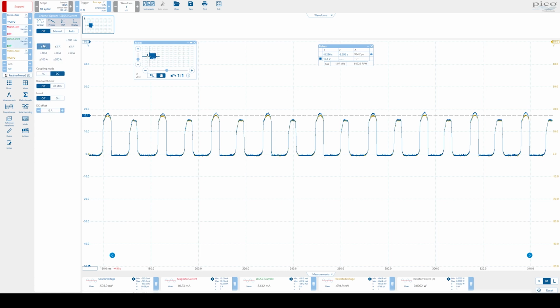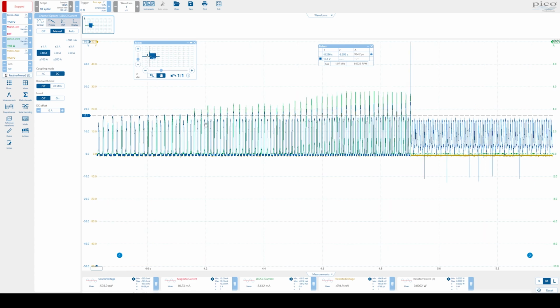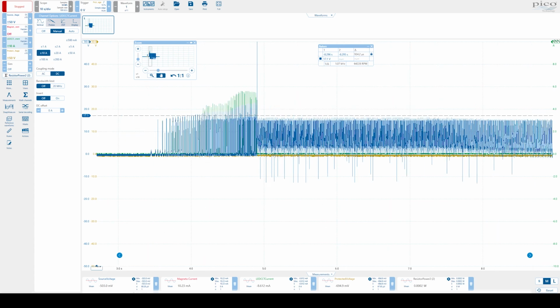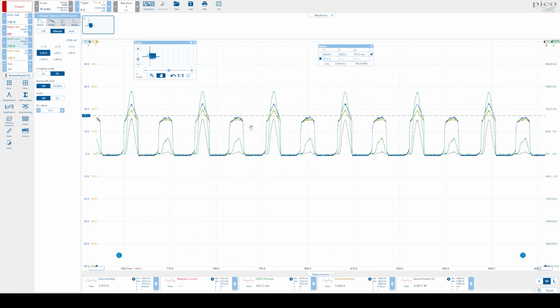And if we add there the LED current, we can see that while the voltage is being clipped, the current goes up, and it's this current that is going to blow the fuse, and the fuses have been selected just to permit that. If we take the average current right before the fuse pops, it's about 700 milliamps. But what we've got on there is we have to add on the light's current, which would be about 1 amp. And we have to take into account the transient currents that are occurring here, which if we inspect some of the currents here, we'll see that it's about 4.5 amps. So with a 1 amp fuse, all these are sufficient to pop the fuse and limit the currents appropriately.